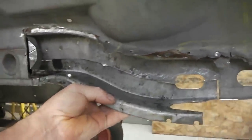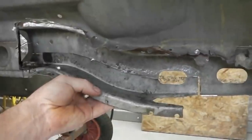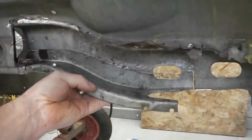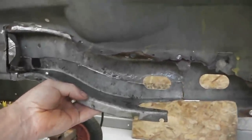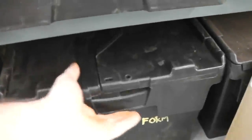Offering it up to the repair area of the C-section chassis offside. So we're going to get some welds on that, some tacks first, and just get it lined up. We'll tap about, feel it flush, and see what we can do.